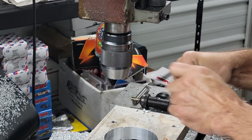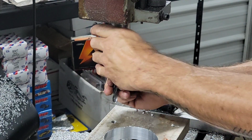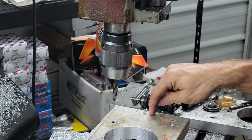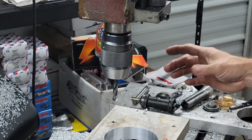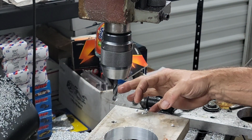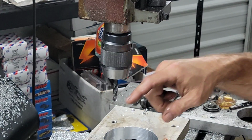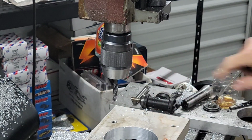All right, so we'll move to our next location. And then I'm just gonna do this 3 more times. And then I gotta put some slots in it on each side for the hone. It's got bolts that clamp it on each side. So I gotta come back and put slots. So I'm gonna drill and tap these other 3, and then I'll bring you back for the slots.